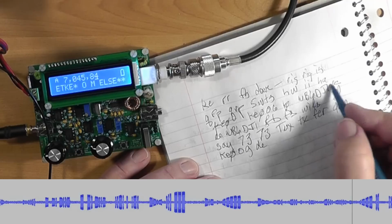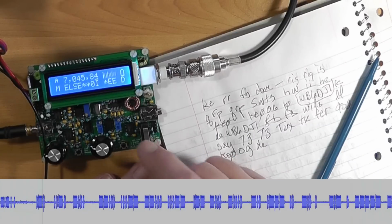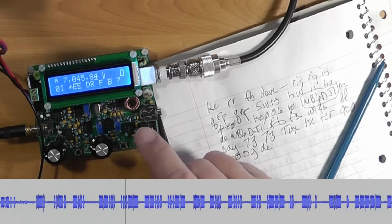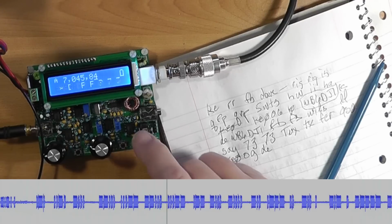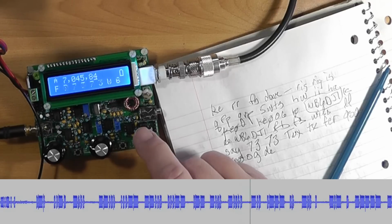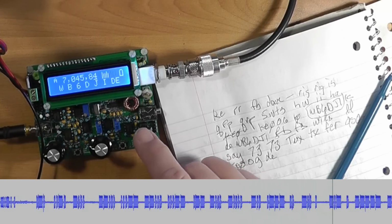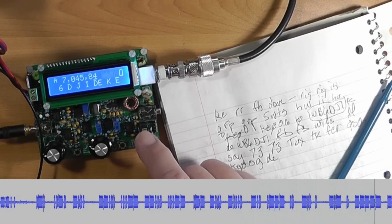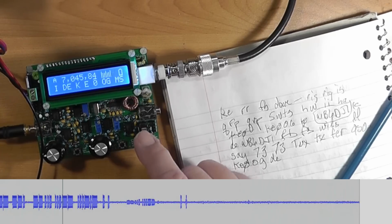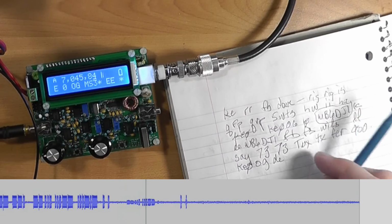So at this point, I'm going to send him 73. I say R and then fine business, and then 73 right there, a couple times, 73. Okay. And then I send his call, and then mine, dah-dit-dit, dit is DE, French for from, DE KE0OG, and I'm going to throw in an extra 73 here at the end. And then da-da-da-da-da is SK, and then the two dits, which is just some little way of signaling, yep, we really are done.